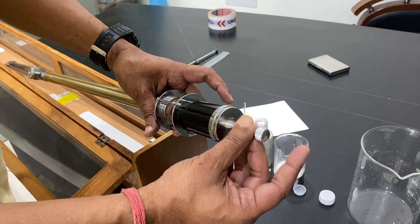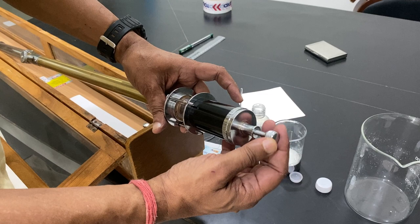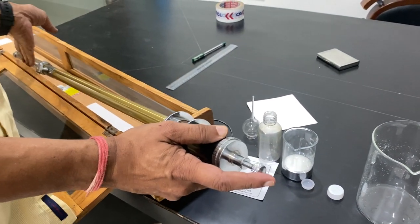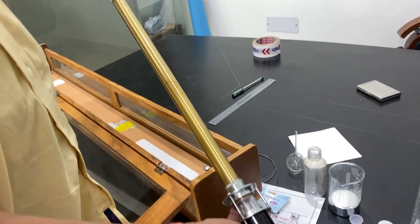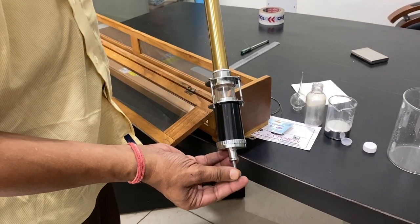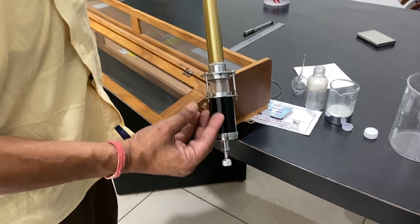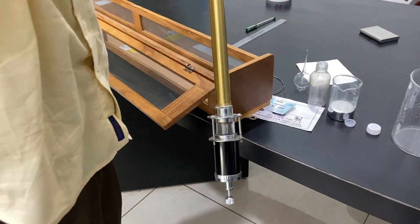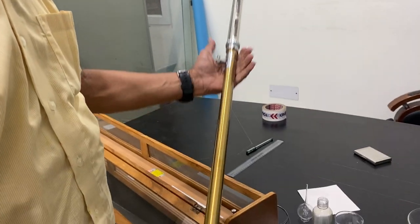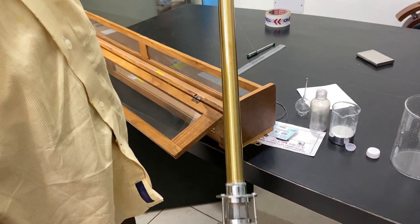Now very slowly, you will push it. Now the mercury — now it is closed. It is not pushing because of the mercury inside. And slowly you have to lift it up this way, then open slowly a little more. Slowly let the blow chamber fill with the mercury, and suddenly you will see that a mercury vacuum is created on the top. If you just move it like this, you will feel the jar. And then you have to hang it slowly.